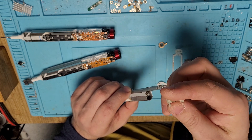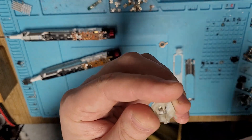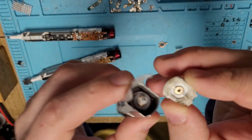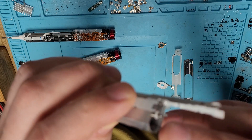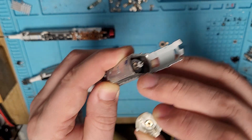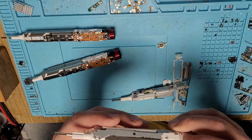What I found is that there are no carbon brushes - it has very soft metal brushes instead. And even though they're so soft, they still manage to damage the collector. You can see it on camera - the collector is visibly damaged even with these soft metal contact plates.